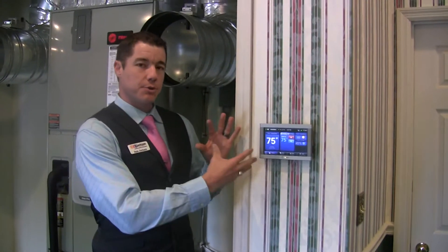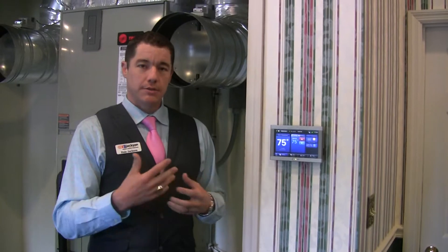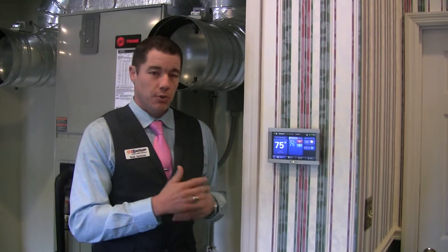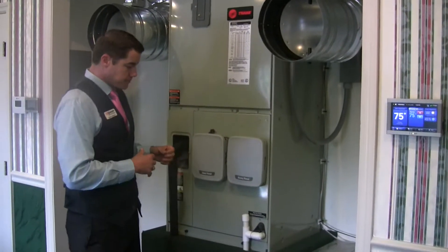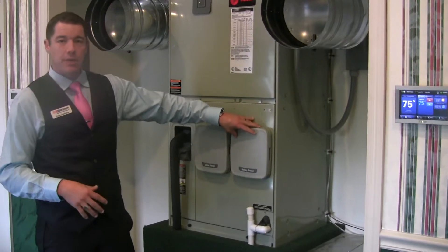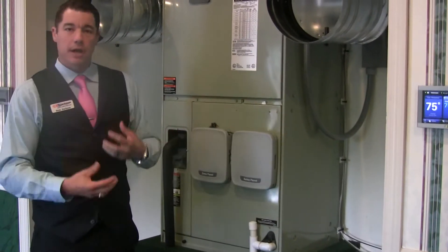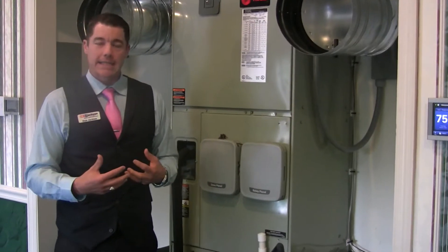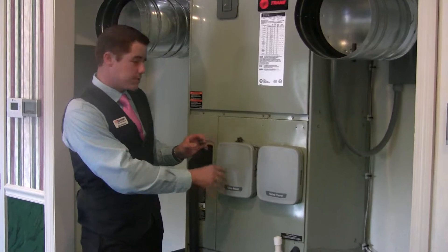The main thing is this is your main controller — this is not the only one that needs to be on and running for your system to cool. We have other parts, and some of those parts we're going to talk about today. This is our relay panel. What this panel does is it takes old technology and upgrades it to what we call communicating technology today. That information is then transferred to the zoning panel.